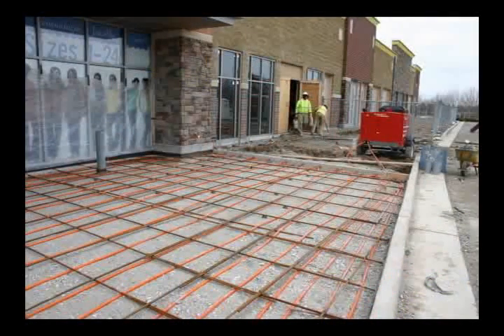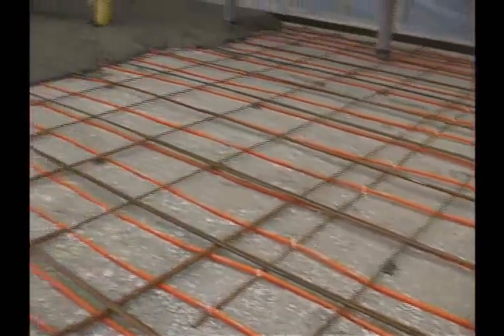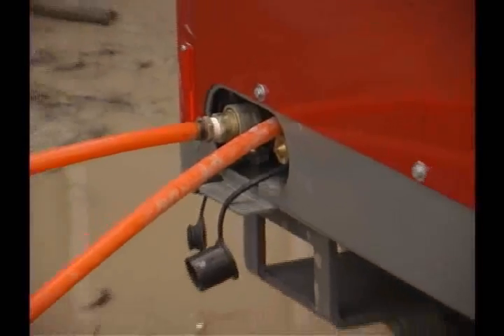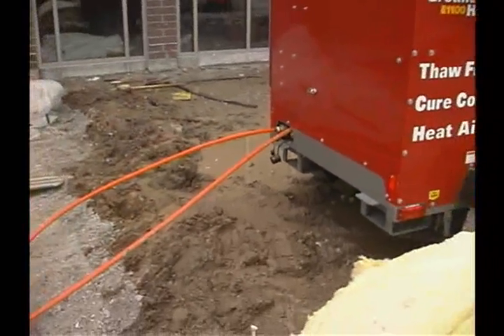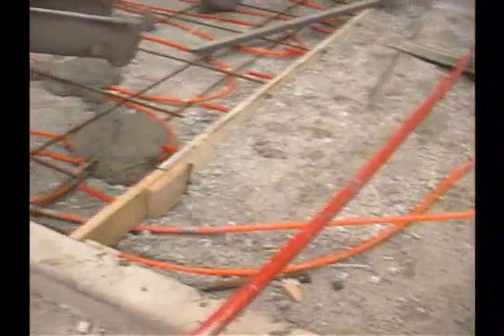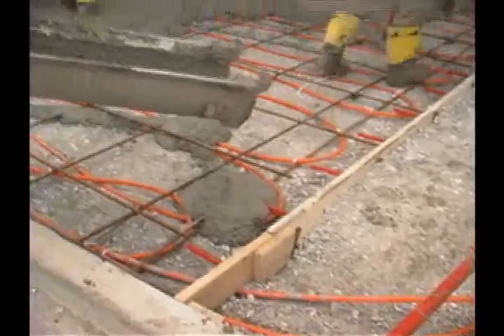It's got a flip pedal and a brake release — can't ask for anything simpler than that. And this is the first time using this PEX tubing system. Yes it is, and it worked out actually a lot easier than we anticipated. We've heated it up to about 170 degrees and it's flexed to one foot increments. Zip tied it to some rebar. We are going to leave it permanently installed after the concrete cures, then drain the glycol out of the tubing and cut the tubing flush with the end of the sidewalk — it'll be forever there.